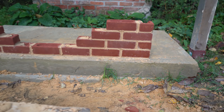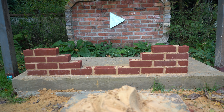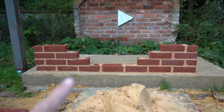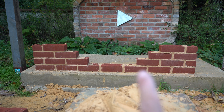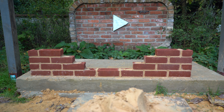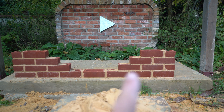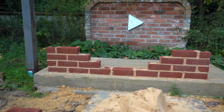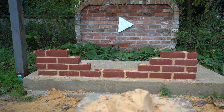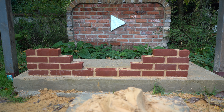In my opinion — and I don't know if it will come out quite as well on camera — but if you look at it in real life from a distance, it does affect the actual colour of the bricks. These on the left side look a lot redder and darker, and on the right side they don't look quite so dark. That is because of the joint size. Some people like this look with the big perps, and I particularly don't — I did this specifically to show you the difference. The left side just looks way neater, and the right side has a bit too much yellow in it.